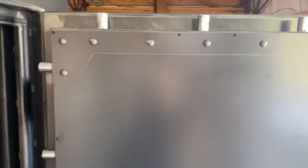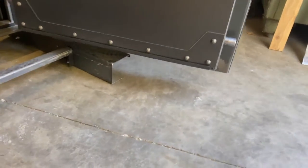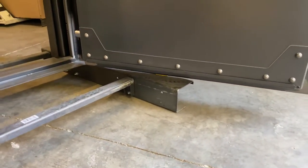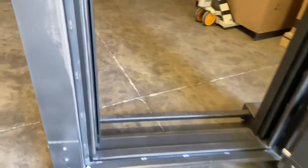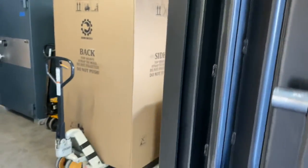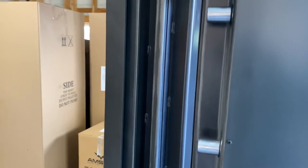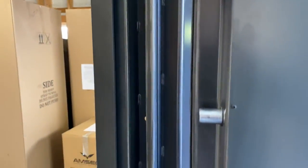Got inch-and-a-quarter bolts here. On this one there's three on top and it looks like about eight running up and down the side. I don't think there's any on the bottom, which you really don't need anyway. Two intumescent fire seals here — there's one on the door right here and then one on the frame. Those should expand when heated to about four or five, maybe six times their size. I've heated them up once — they're pretty cool, they get real fibrous, but they do a good job of expanding.